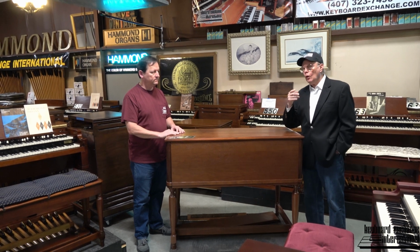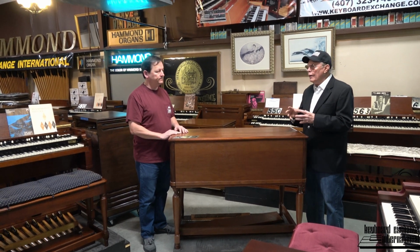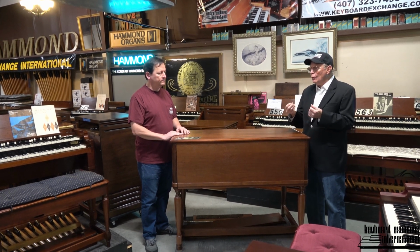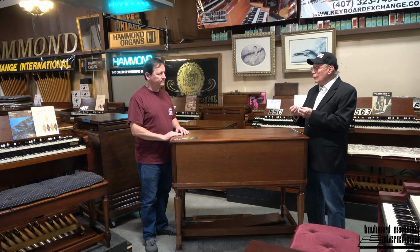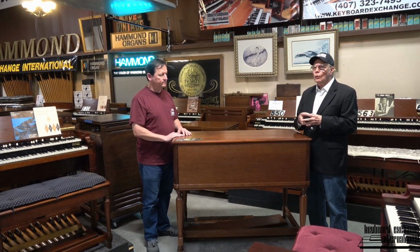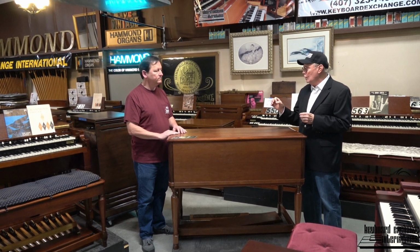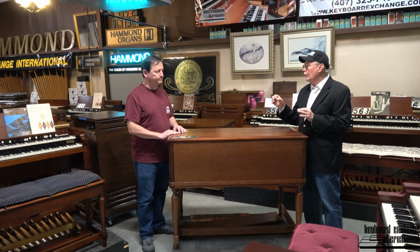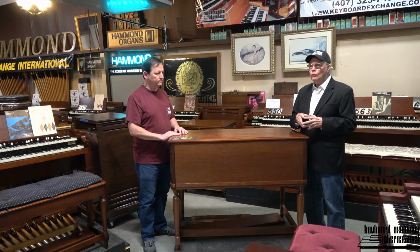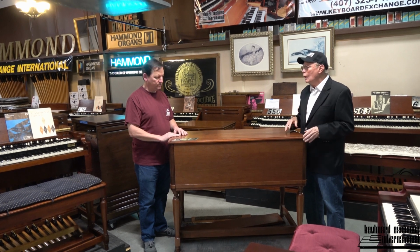Now, Bill and I were talking the other day. He said, "Gee, every organ that I redo the wiring on, the wire comes out brittle. The insulation, the rubber insulation, just breaks apart in my hands, and you're looking at bare wire." So back in the 50s and early 60s when these Hammonds were made, they used a rubber-coated insulation on their electrical wires. So now the more modern way to do that is use vinyl-covered wire for the insulating factor. Correct. So that's what we do.